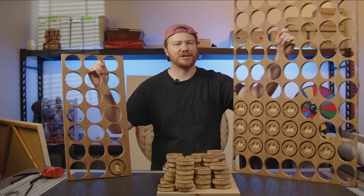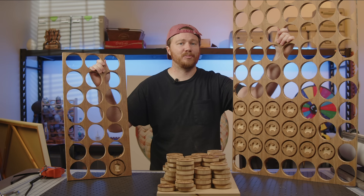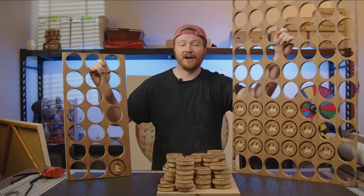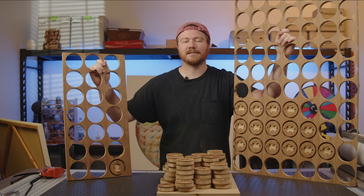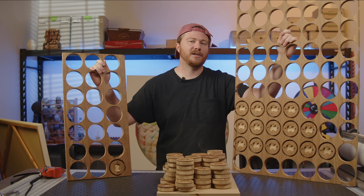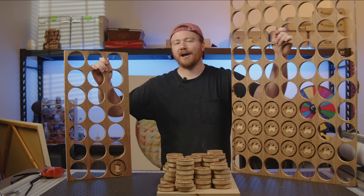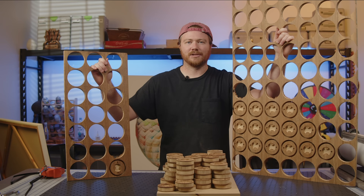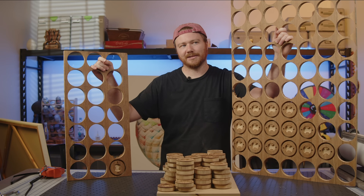Now of course it was not all sunshine and rainbows like I thought it was. A lot of these did profile and really did stay put and I was very pleased with that, but I didn't realize that some of the parts did not cut all the way through. I went ahead and pulled out all the pieces I could and some of them had a little bit of onion skinning. I would say that probably half of them were fully profiled through, and out of that half, only three of them were really knocked loose — causing one to absolutely fail because we had a lot of marks on the sides.